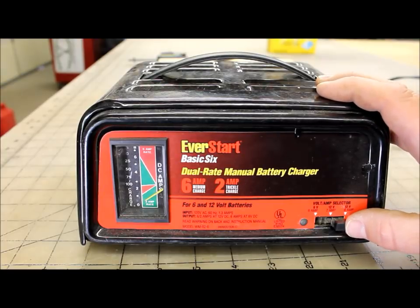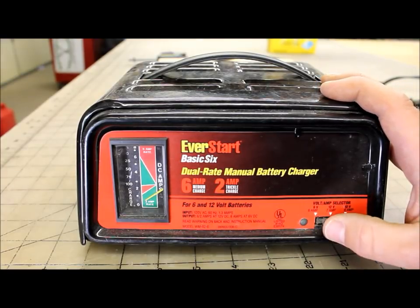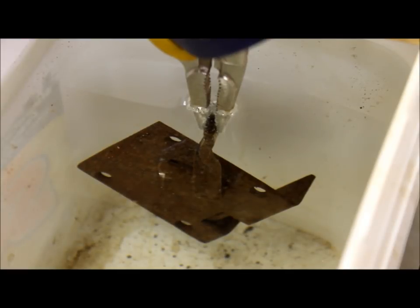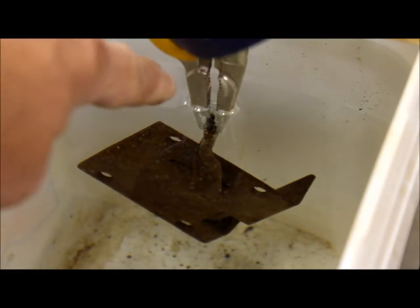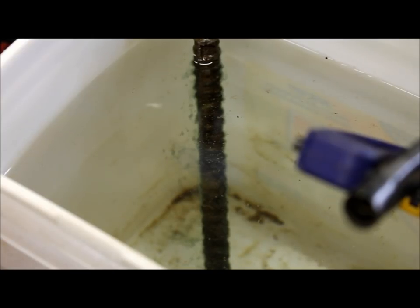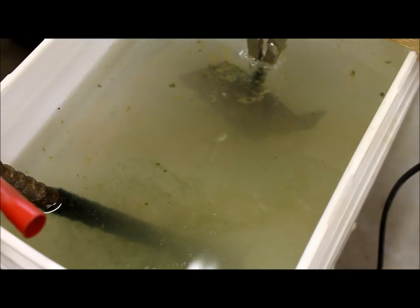You're going to set your battery charger to the lowest 12-volt 2-amp setting. This part's been in here for less than 2 minutes and you can already see the bubbles — so it's already working. We're going to go ahead and leave this part in there overnight. There will be a nice nasty filmy gunk on top, but we'll let this work for about 12 to 24 hours and then come back and check on it. Look at the junk already starting to collect around that rod — this is after only about 10 minutes. Look how nasty that water is already looking.